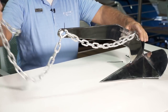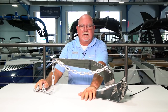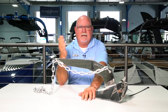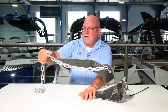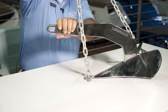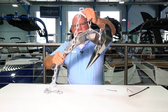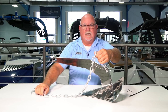Typically if your anchor comes free normally, it's just going to come up just like that. Now if it gets wedged under something, you've got two options: you can record your spot with your GPS, cut the line, go back and retrieve it another day with somebody that knows how to dive. Otherwise, if you want to use this method, your zip tie will break when you're pulling up. It comes loose, the windlass pulls it up, the anchor spins up backwards, and you retrieve it that way — it slides out from under the obstruction.